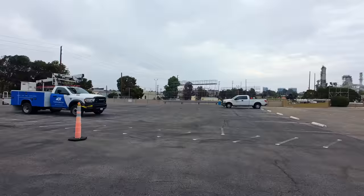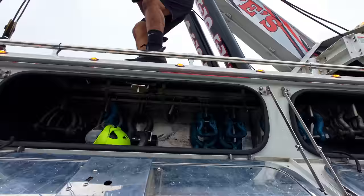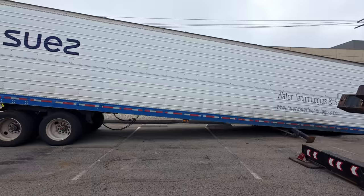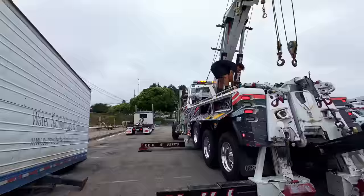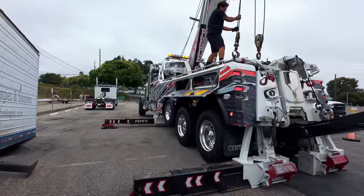Right now, when talking with the people that called us, they don't anticipate it to be fully loaded, which is good. Well, I bet the whole entire thing weighs maybe like 20,000 pounds and I'm only picking up the front. Therefore, I'm not gonna combine my lines, where I take off the block right here and one line is married to the other one in one continuous loop. I'm gonna take off the free spool.